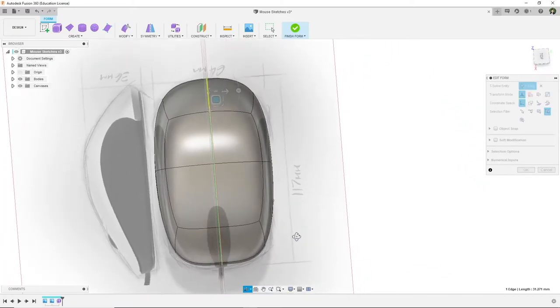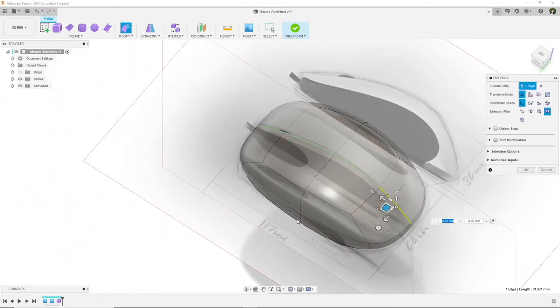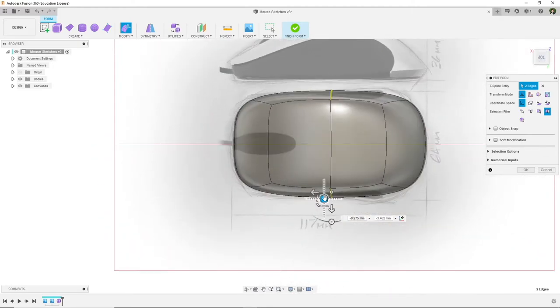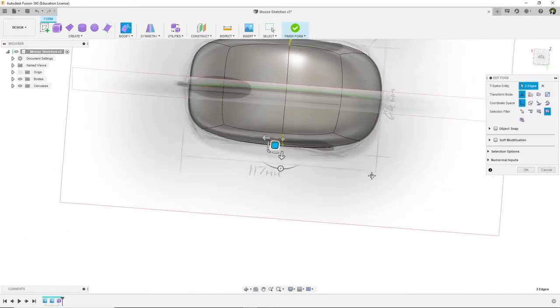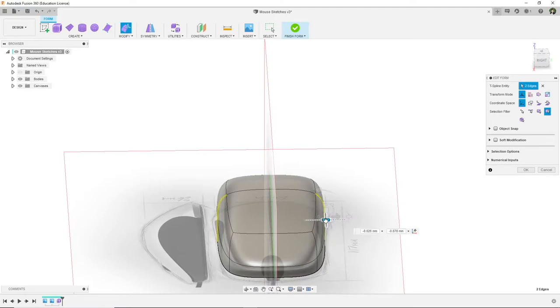These are the two profiles that we have. From our canvas, I just drag the center in slightly just to match. But we need to be careful because don't forget this is being molded. So if we have too much of a profile going down, then the draft angles won't work. I'll just drag that in a little bit there.